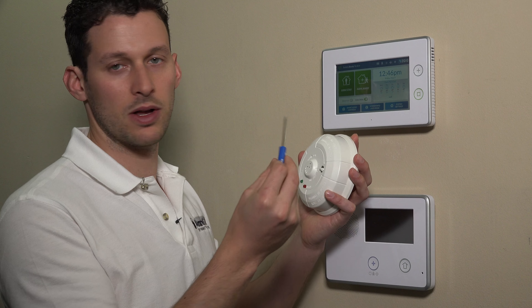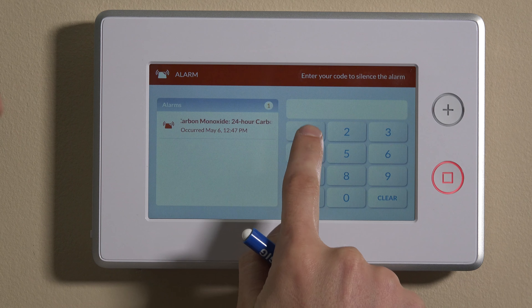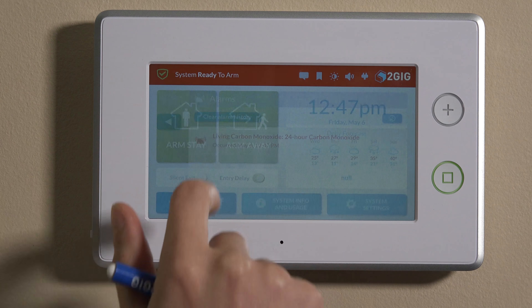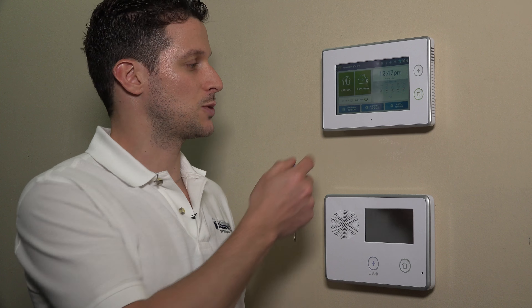At this point, you can take a small enough device to get into the test or hush button here and press and hold it for three seconds. It'll say carbon monoxide. We can hit our master code to clear that out — it'll say alarm report already transmitted, and we can clear that out. That's how you would test this unit and make sure it is communicating. At that point, you could reach out to the central station and confirm they got the signal to verify that reporting from the GC3 is working, whether it be through an alarm.com radio. This panel does actually support Wi-Fi, so that might be another communication path through a future firmware update. If you have any other questions on your 5800CO, you can email us at support@alarmgrid.com. Don't forget to subscribe to our channel.